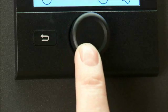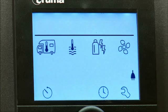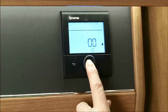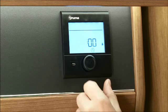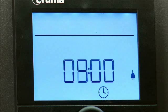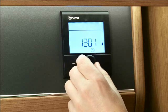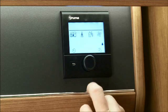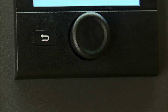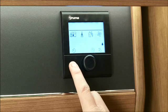You do this by turning the central control knob, moving along the bottom icons to the small clock symbol. Once you're on it, push to confirm that you want to set the time. This control panel allows you to select either timed operation, where you define preset operating times, or manual control for a more immediate demand for heating or hot water. The small curved arrow key next to the main control knob is the back key. When pressed, it will take you back to the main menu.